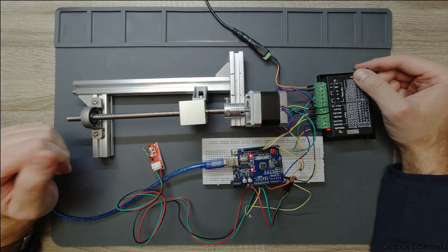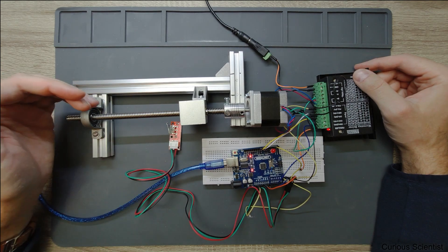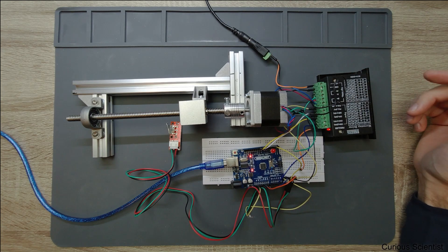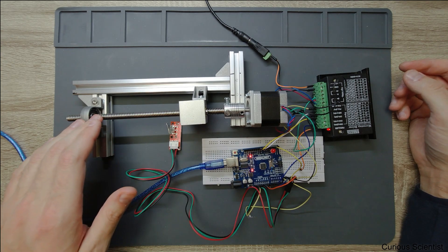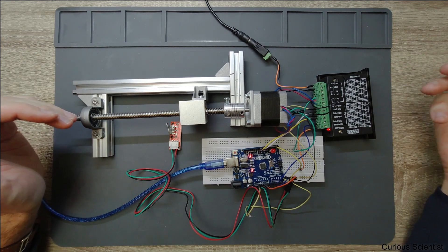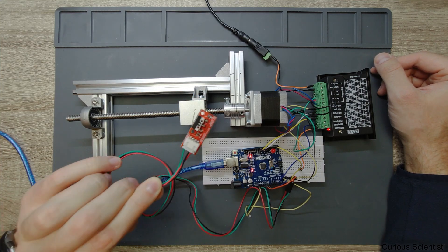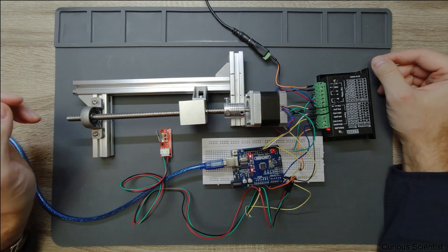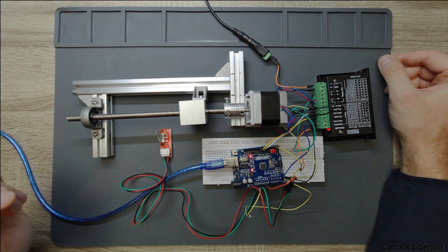I will say that I want to have this position near the bearing as my origin. Then I will see how I move this block and where to place the micro switch. Whenever I move this block and ask the motor to do homing, it will move in a certain direction and with a certain speed — both of which I have to code — and whenever the limit switch is hit, everything will stop.